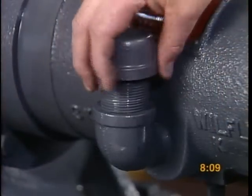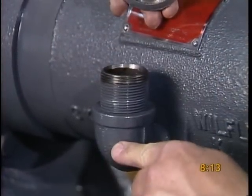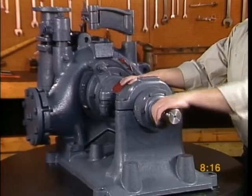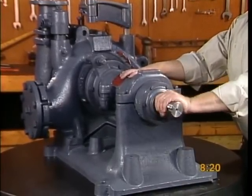Be sure the pump is filled to the bottom of the filler elbow with clean oil. If installation is delayed, turn the shaft once a week to lubricate the bearings. Store the pump in a dry location away from any vibration to prevent rusting or bearing damage.